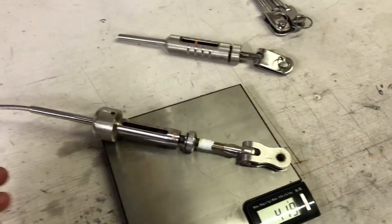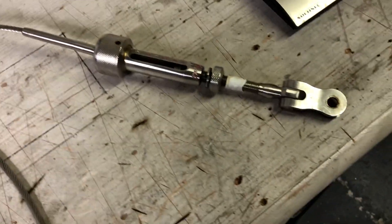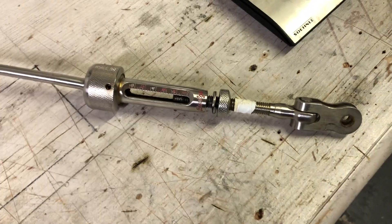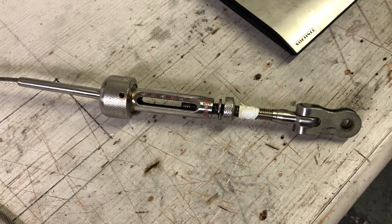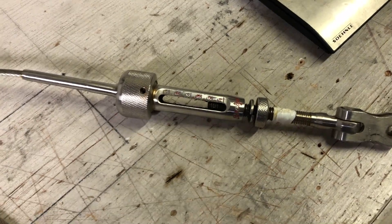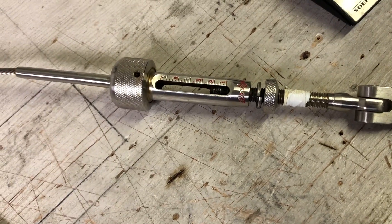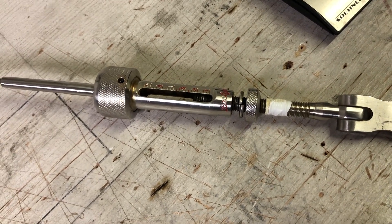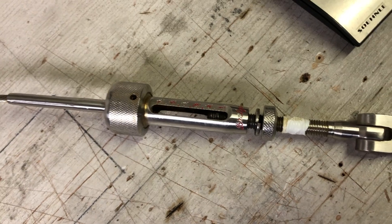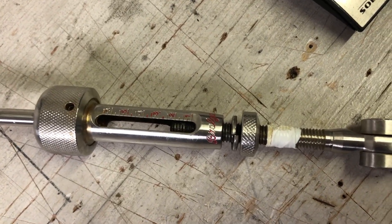Next is just to highlight some of the basic differences between the two. The Brelga is almost 20 years old now as a product — ahead of its time for sure, a really cool product. It allows the shroud to be adjusted from the windward side in any conditions we sail the Etchells — I can adjust it in over 20 knots on the windward side going upwind under full load.